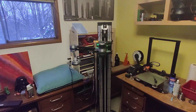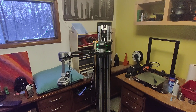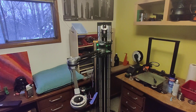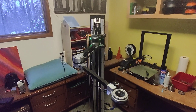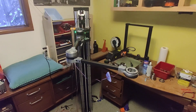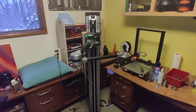The main movements are there now, so this is working. I have a bigger version with the double arms I just talked about, and I was also thinking about making a really small version where each arm would only be about 125 to 150 millimeters — it would probably have about a 100 millimeter cube print volume, just as a fun thing to make. So that's it: got the wrist joint working, homing works, everything works, now it's just time to attach a hot end and extruder and hopefully print large things — that aren't very accurate, because that's not what it's designed for.